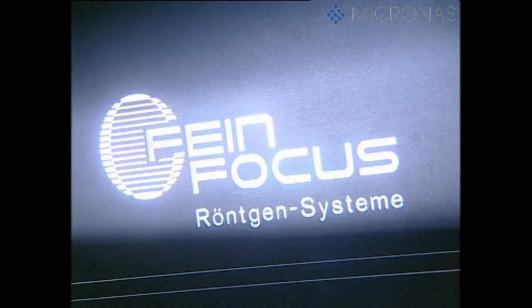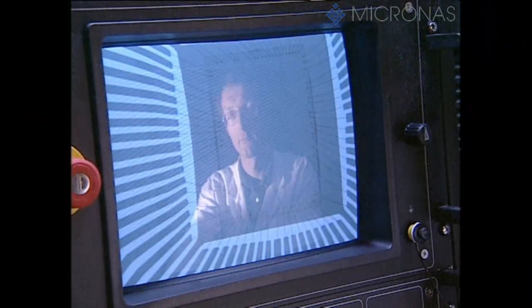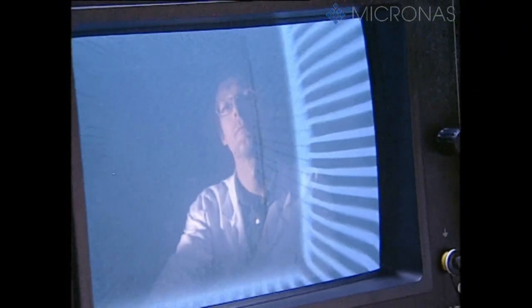When the molded component is inspected in an X-ray microscope, a highly enlarged shadow image of the interior is seen. This serves to confirm that the molding operation has not changed the position or course of the fine gold wires.